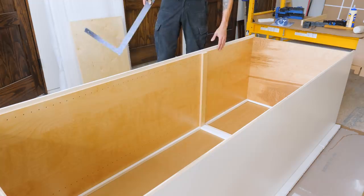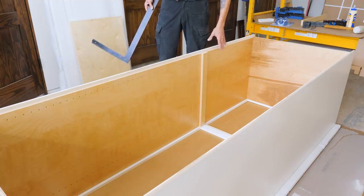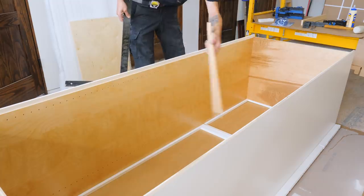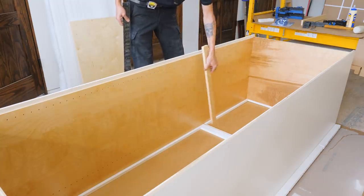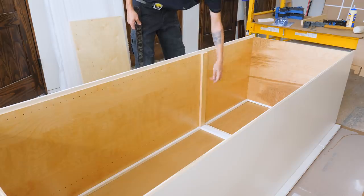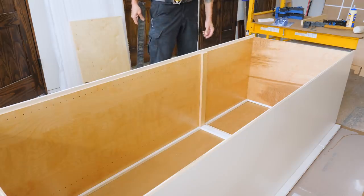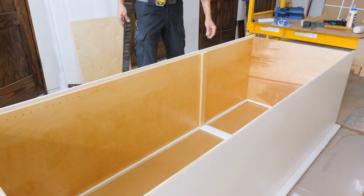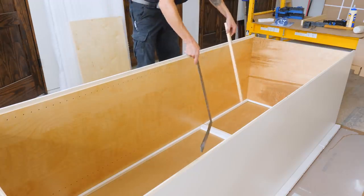When you do a custom sized case only option, they don't route out these middle shelves. They just give you the box. But they do give you these supports, and they're the perfect width as the face frame to support a shelf. So we're gonna pin these in here, put the shelf here, and you won't ever see it. All right, so we're gonna mount this,